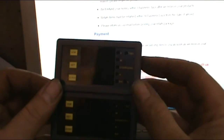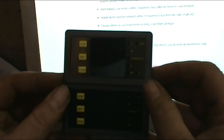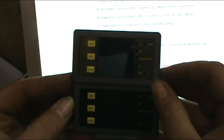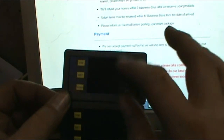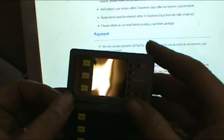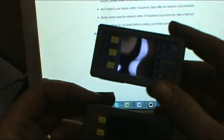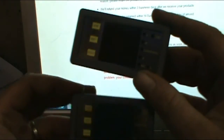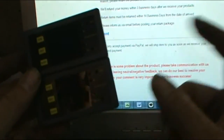We'll be using them up top. I'll probably have one on my meters coming from my turbine, and the other one going to my battery bank so I can see exactly what's going in. I can also see when my battery bank is in discharge mode — how much power is being used and put back in, especially when my dump load kicks on. Instead of two large meters taking up space, I'll have one for solar and one for the turbine or multiple turbines.